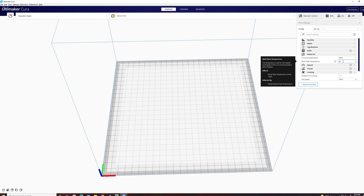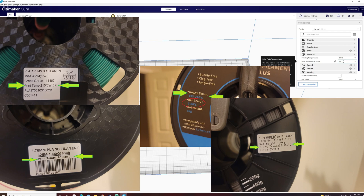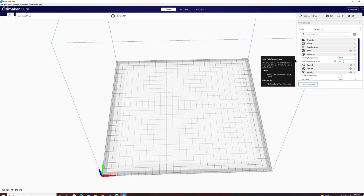The nozzle temperature is a little low, in my opinion, for most PLAs, but it should get the job done. This is a generic run-of-the-mill setting that should work or come close to working for most filament types. I'm going to throw up a couple of images of some spools in my collection — most spools have the temperature printed right on them, showing the range. You'll see that 200°C kind of cuts it for all of them except for PETG, but it's on the low side. I like to go 220°C personally.